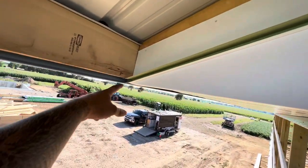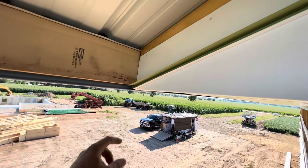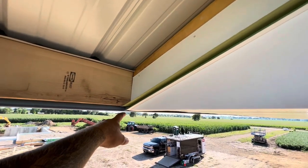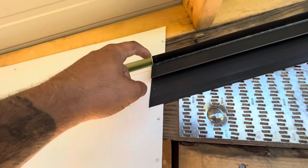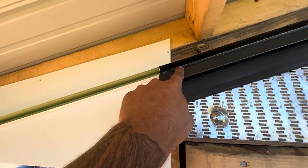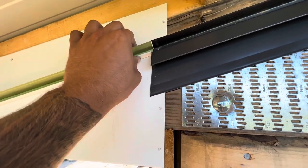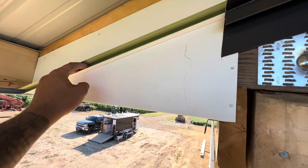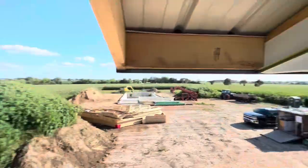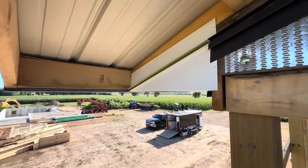For the J-channel: cut the back side with two cuts about a quarter inch apart and then a little cut down to the face so you can do a nifty little bend to tuck into the fascia on that side without a seam. On the other end, snip back the top and bottom legs — there's no nailing out here at the end of the truss — then leave a piece long behind it. Put a trim nail through and it'll grab that piece and pin everything together, which is good enough to hold a chunk of soffit. Unfortunately I'll have to run some touch-up paint on this one, but the only people who'll see it are the children of the corn — corny joke, moving on. Let's get this side soffited out and see how it finishes up.